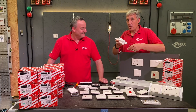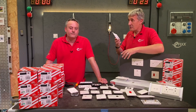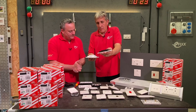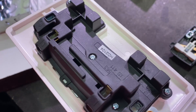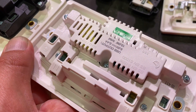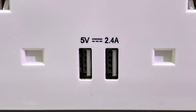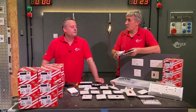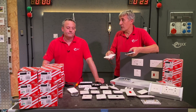Almost as popular as the Base double socket now is the USB socket. What I like is the way it's manufactured to fit in with the range - you can see where the USB element fits in, it just drops in, using the same frame for both socket outlets. It's 5V, 2.4 amps shared across the outlets - a great addition for what is a budget range.